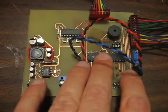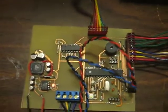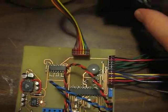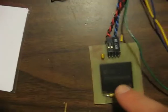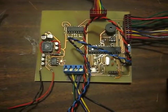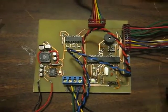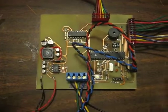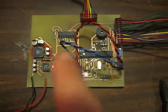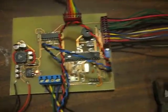And this is where the ID check is actually compared. Or actually, the check itself is not performed. It checks to see if there is one waiting. So if a user enters something on the keypad or on the RFID scanner, it stores that in memory because it's a part of a slave system. It doesn't actually volunteer the fact that it has an ID ready and waiting. When the packet comes all the way down from the server to the interior unit to here for an ID check, at that point it responds that yes, I have an ID waiting that was entered some time ago to be checked. Now in practice the amount of time is in milliseconds, but